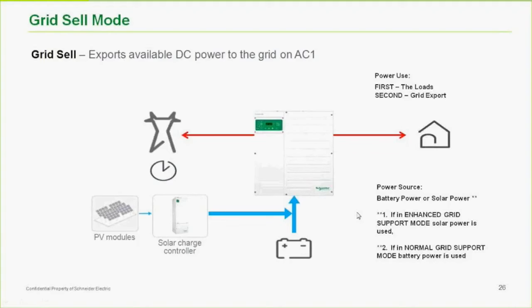We still allow the batteries to go through a full three-stage charging cycle every day. Any excess above and beyond those individual targets, in other words, if we go to bulk in the morning with the charge controller, any energy above and beyond bulk will go back to the grid during the absorb time. Once we go down to float, then any energy above and beyond the float will go back to the grid, but we'll never pull from the batteries unless we hit refloat again. So it's a better way to do things, more efficient and easier on your batteries.